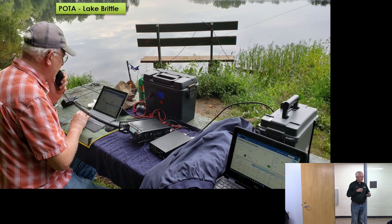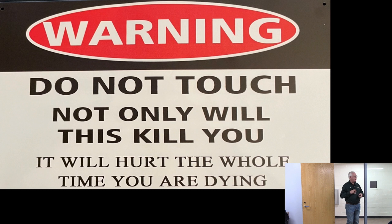There are all kinds of ways to deal with this setup. One thing you do have to be careful of: the hot point on these antennas is high voltage — between 2,000 and 3,000 volts on the antenna output because it's a high-voltage, low-current feed point. You need to make sure strangers don't walk up and touch the transformer when you're operating — you could get a nasty RF burn and a real shock. Keep the muggles away from where you're operating.